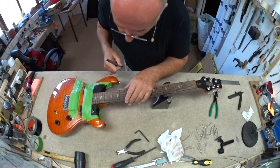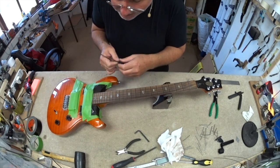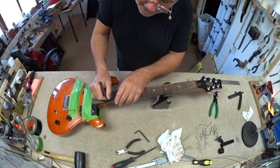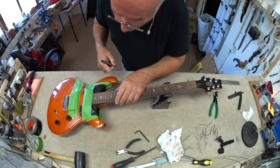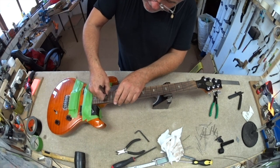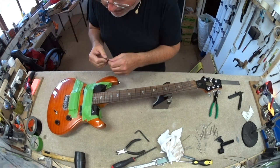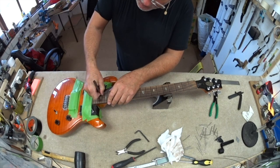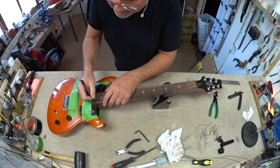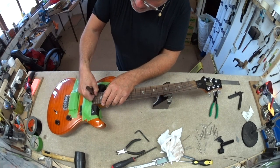So I would be much more comfortable if, and this should be my watchword, my benchmark, I'll start with tapping it in and wood gluing it down on the bench there in a short while, because the truth is I can probably afford a good few hours for it to set enough to end bevel, edge bevel. So I will, as I say, start with tapping the frets in, assuming that they'll fit pretty cleanly but not excessively tight, which is exactly what we want.